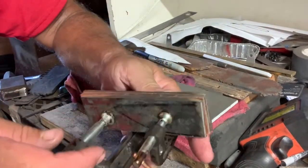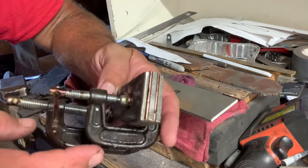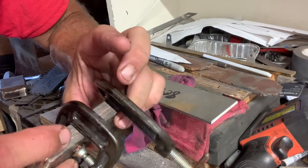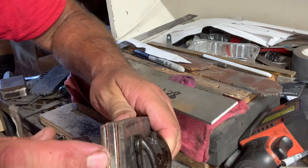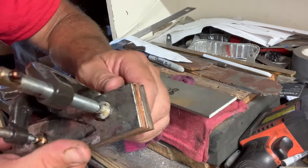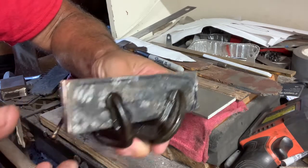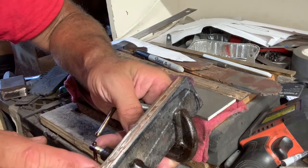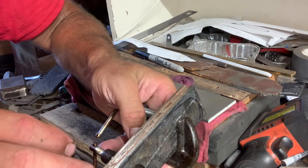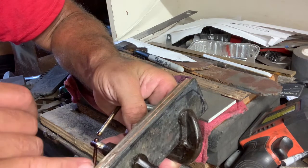I thought I'd show a quick pick of this. I've got it all cleaned up — the outside of the Damascus didn't matter, but the inside's clean. I've got it squared up; I went ahead and ground the sides to where it was all matching. Only thing left is to weld a little handle, tack it, and cut it off so it matches perfectly. My dilemma is whether or not to completely close this off. Most of the videos I watched, they do some type of sealing — either weld the seams or put another piece of metal to keep the copper from squirting out if it gets too hot.